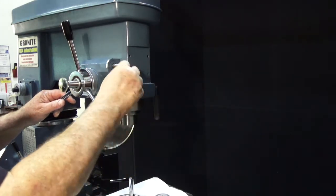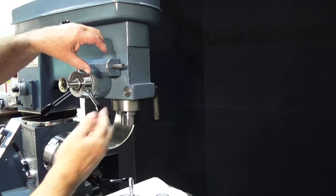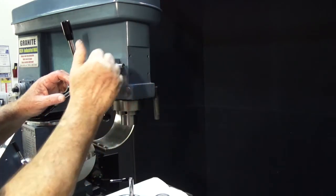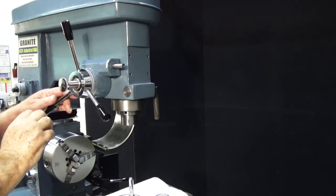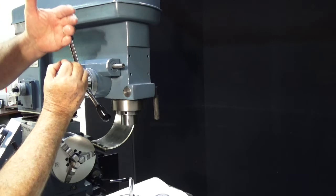The hole through the center of this bushing is offset. So by rotating the bushing, we can move this shaft up and down, and that will help to make this worm gear connect better to the big round gear that's inside here. So we've got the round gear and the worm gear — we're going to move the worm gear up and down.